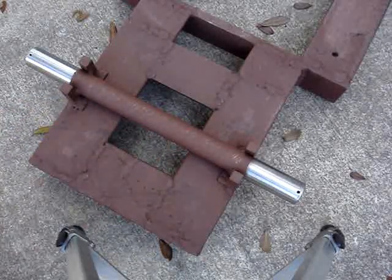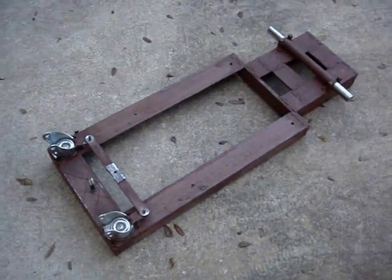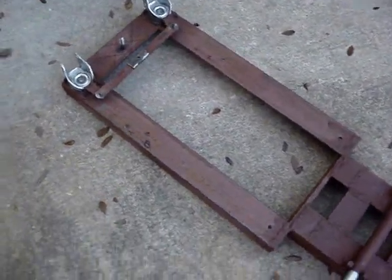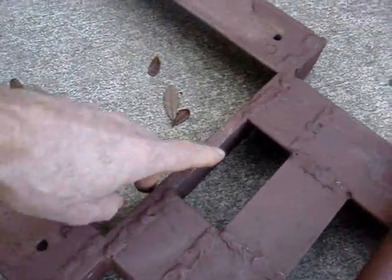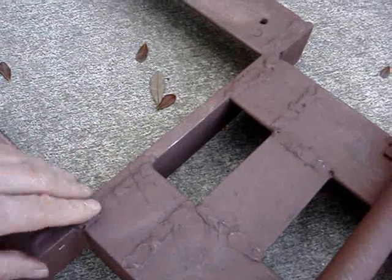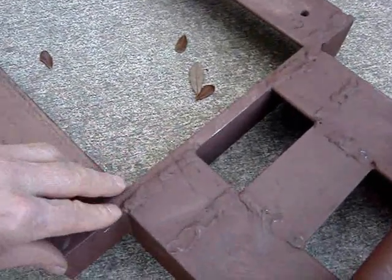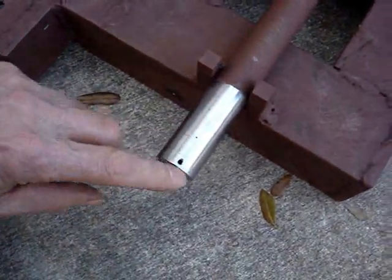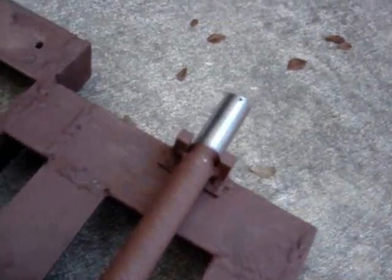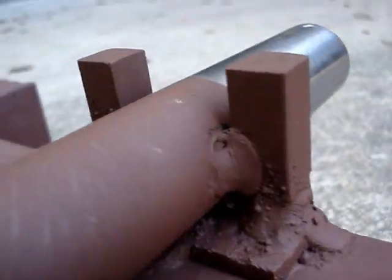Here's what the entire dolly looks like viewed from the bottom. It's built out of 3/8 by 2-1/2 angle, except this crossbar here which is 1/2 by 2-1/2 — it's hot-dip galvanized, so I had to grind all the galvanized off before I could weld it. This is where the 8-inch wheels go at the back, and it's kind of an odd configuration — I needed this axle to be up 3/16 of an inch higher than the rear of the frame.